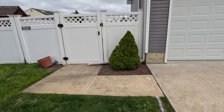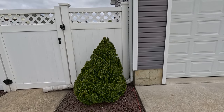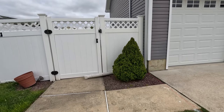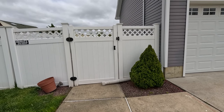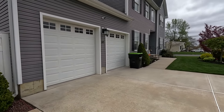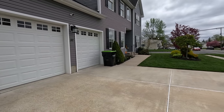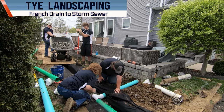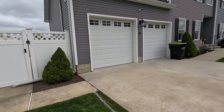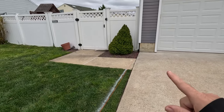They do have a basement with a sump pump, and normally the town will say no to this because they assume you're going to just be putting the sump pump in there. But at least 2 years ago, we put a big system in the back. So there's a French drain, a yard drain, and a sump pump, and it runs to the side street over there. There is a street storm sewer that we tied into. I'll link the video in the description if you're interested. So since the town knows that we did this, because that needed a permit also, they allowed this.